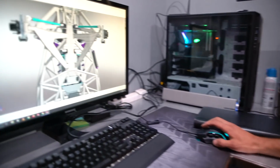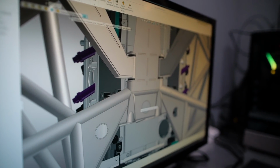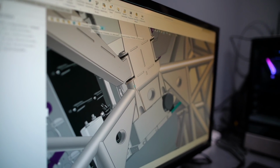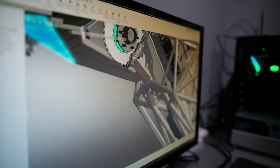So another cool thing is where a lot of trucks and a lot of other vehicles, you see failure points or stress points in the rear pickup of the lower arms. So the bulkhead for the entire front end is so stout, and it ties into a ton of the chassis. Check this out. This is the whole bulkhead section where the arms mount, and this is where it comes through the chassis tubes, and you can see there's a lot of plate work to tie it all together. These bolts actually come through this center section, and it helps hold everything together that way.